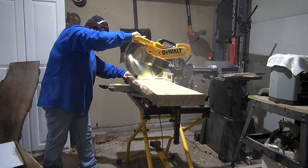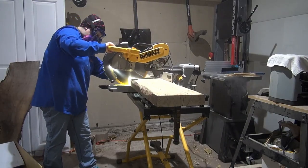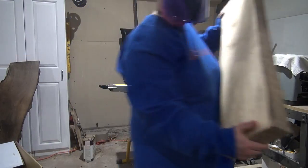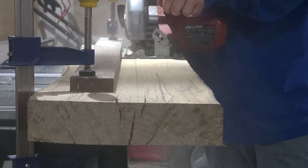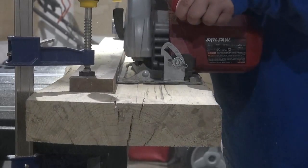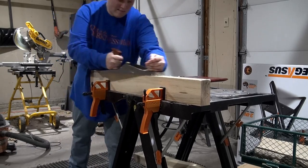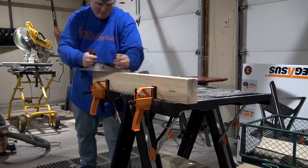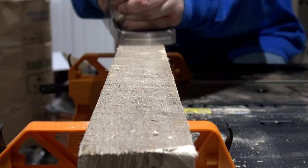Okay, so I have the top done. Now I need to go on to the beam. The sawmill didn't have any more hard maple currently on hand, so I picked up some hackberry — when I was at the sawmill with the clients, they had seen a bigger slab of hackberry and thought it looked pretty cool, so I figured it would do just fine. I don't have a table saw, so I'm just using my circular saw to cut down this piece of wood. I need a beam that is just four inches wide — that's the width of the brackets on the A-frame. So I cut it down to just over four inches wide, and then I decided to use the hand plane, and the belt sander a little bit too, to get it down to just very slightly — like an eighth of an inch — under four inches wide.